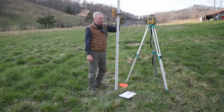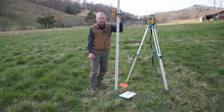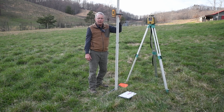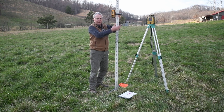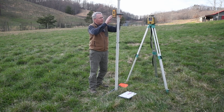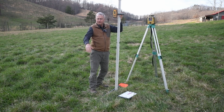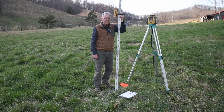So now what we can do is move around with this rod. If we go on higher ground, we're going to read a lower number because the base of the rod is on higher ground. But if we go on lower ground, we're going to read a higher number because the rod is down lower. Now we're going to go to higher ground and take a reading, and after that we'll go to lower ground and take a reading to show you how the numbers change.